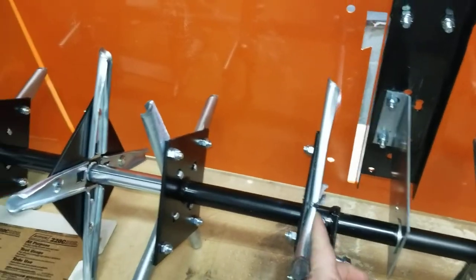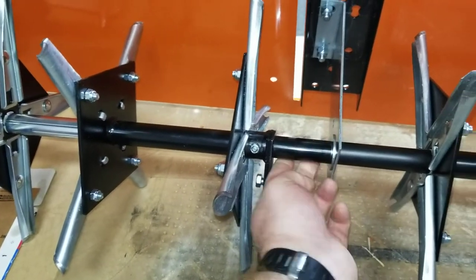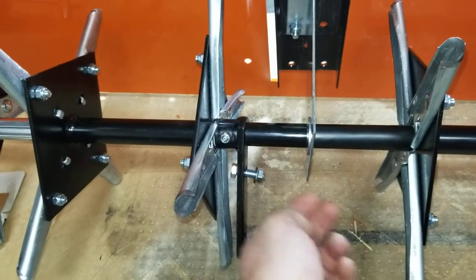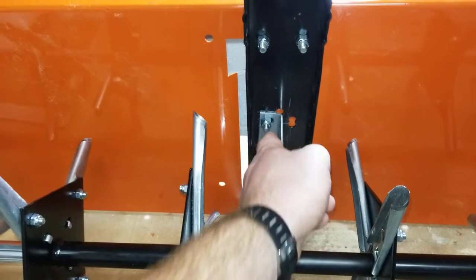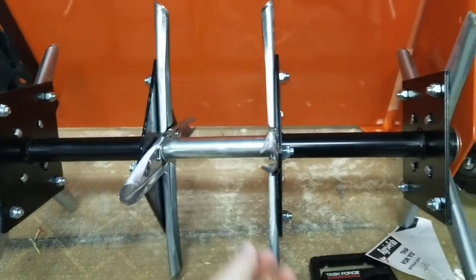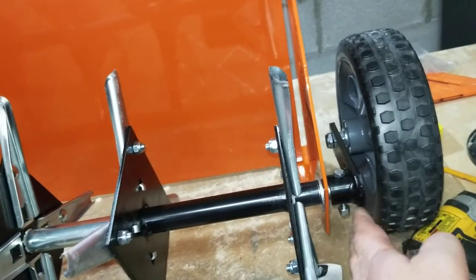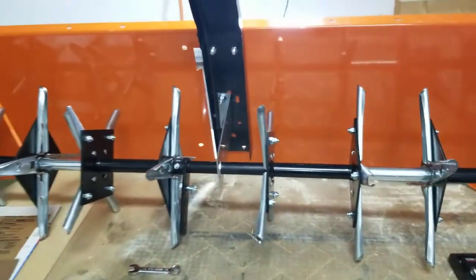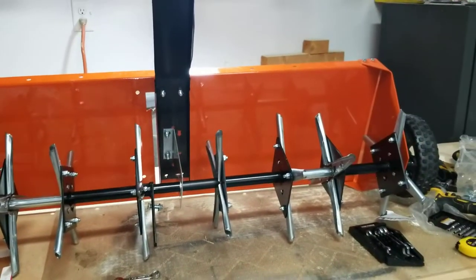This is what they call the short end right here, because this is where you end up doing this: you have a two-inch spacer here, a five-inch spacer over here. You're supposed to put this part in, orient it like this, then another spindle metal piece, a spacer, another spindle, an inch spacer, washers, and then your wheel assembly. This is how I would have done it had I known.